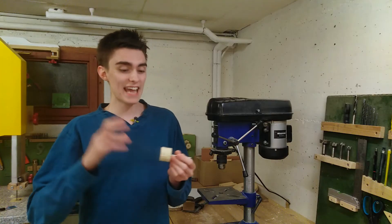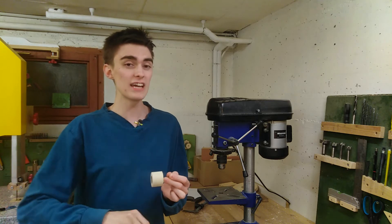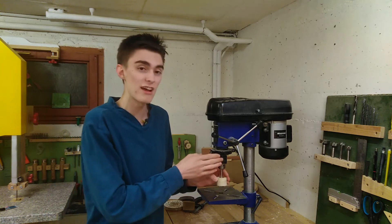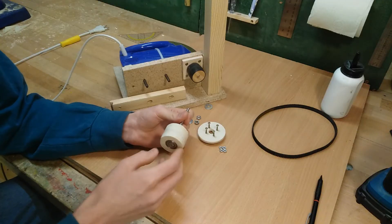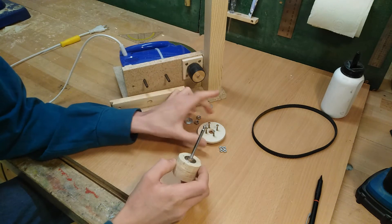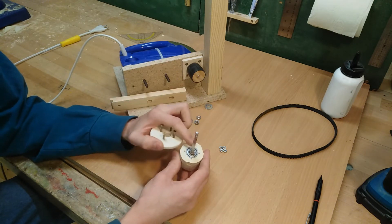The tricky part about this industrial design — having the wheel spin freely on the shaft instead of having the shaft spin with it — is that I can't put it in the drill press to turn it into a nice round wheel anymore; it would literally spin on the shaft. So what I came up with was to screw a temporary pulley to the wheel itself — that's what these screw holes are for.